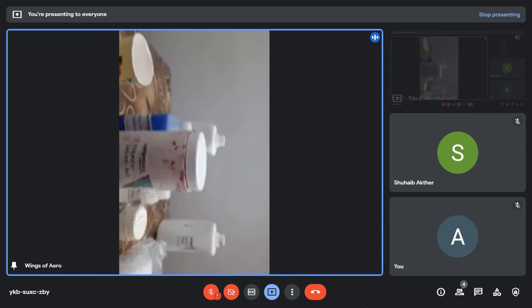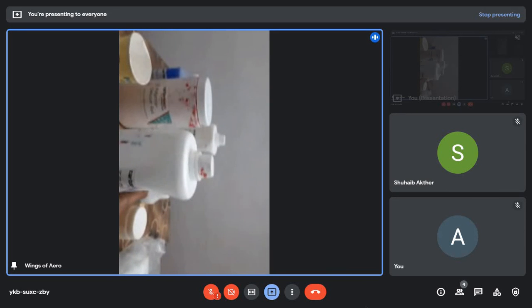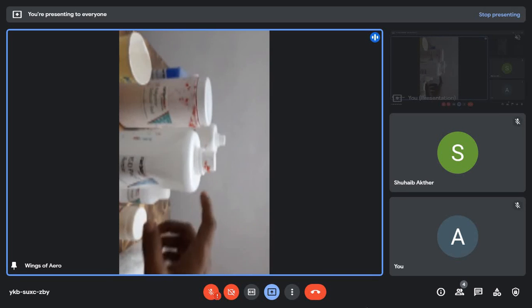But now we have red polyester gel coat, and as a resin we are using ISO polyester resin. It is a synthetic resin formed by the reaction of dibasic organic acids and polyhydric alcohols. Combined with the polyester gel coat, it gives a good connection and bonding with the reinforced fiberglass material. It reacts with organic acid and gives good bonding with each other. It's also called polyhydric alcohol.